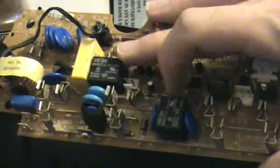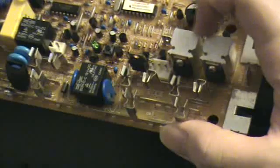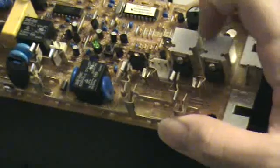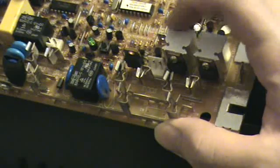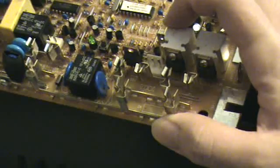The inverter connects the transformer — this big thing here that I showed you earlier — as a step-up transformer. At the same time, it turns on these two transistors here. These are P55NF MOSFETs, and they switch the battery into the low voltage primaries of the transformer.